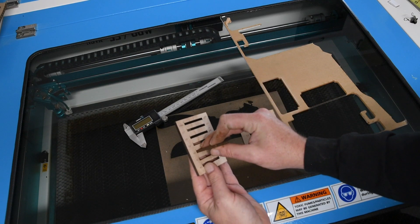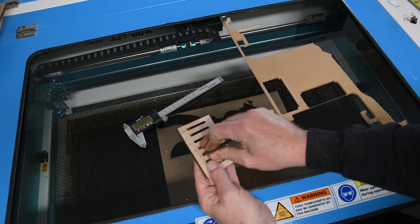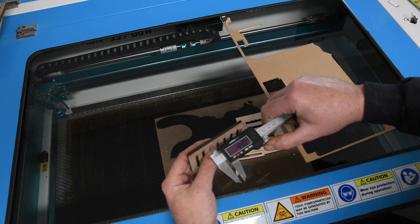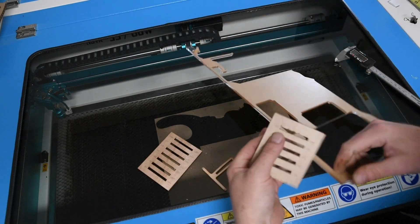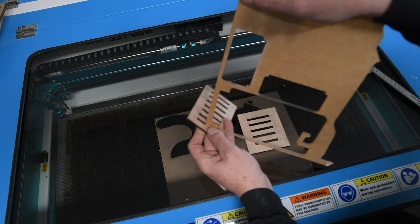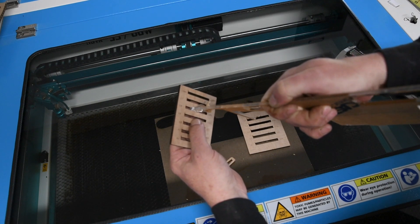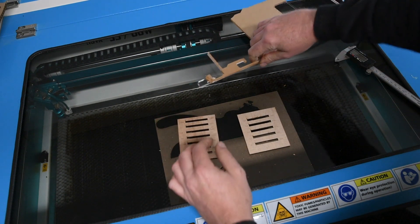If I wanted this wood to slot, I would cut it exactly at four millimeters, because the kerf has already been cut off here — the laser has already removed that material. So if I measure this piece it's probably about 4.4mm. With acrylic, you want to remove the paper first because you'll get a different reading. With paper on, acrylic is tight at 4.2, but without the paper it falls right through. Without paper, about 3.8 is where it's a tight fit.